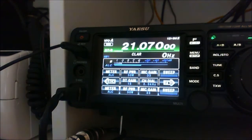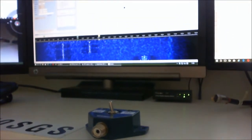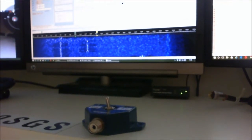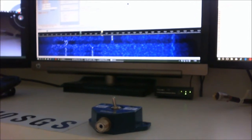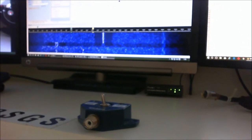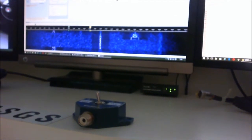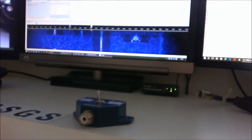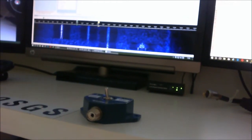If you can see the ALC on the screen there for PSK modes — there's not really anybody using a really bad wide signal, but if they were you'd have about two or three echoes. If you see that main one coming down in the centre of the screen, there'd be echoes right the way across, suggesting he's using too much ALC. As you can see here, these are fairly clean with no multiples of the same signal.